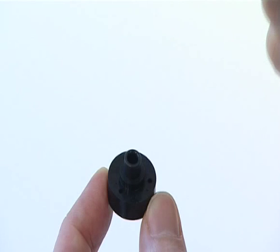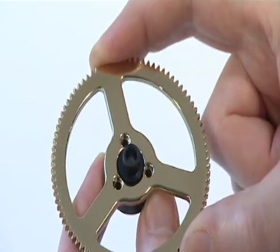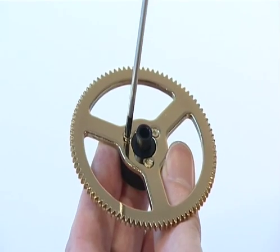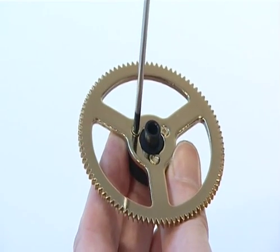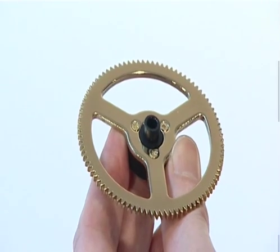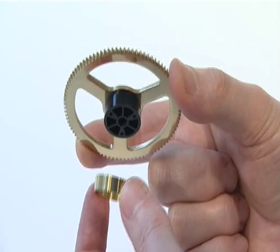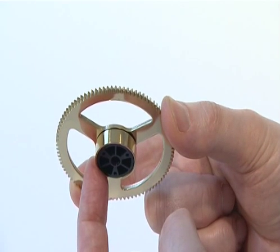The fifth phase of Stage 2 adds the midsection supplied with Issues 13 and 14. Take the 91 tooth gear and insert the large plastic spindle collar in the centre. Align the countersunk screw holes and secure with three KB 2.3 self-tapping screws. Ensure the collar is firm but don't over-tighten the screws. Place the large brass collar over the large plastic spindle collar.